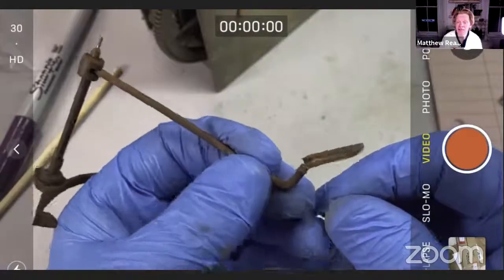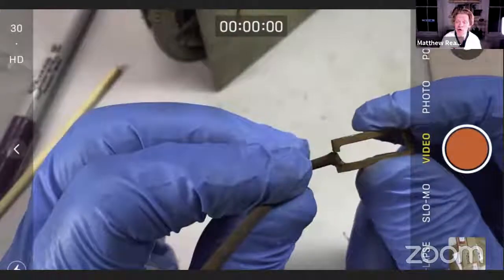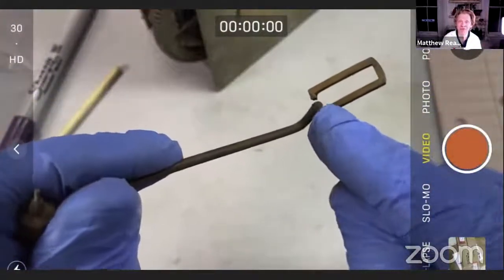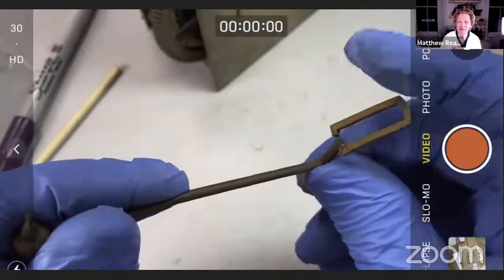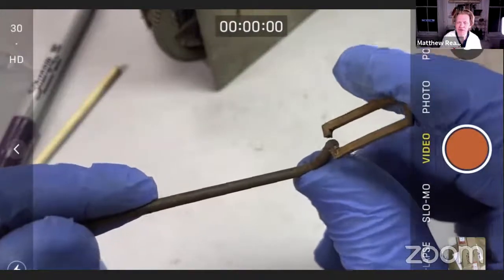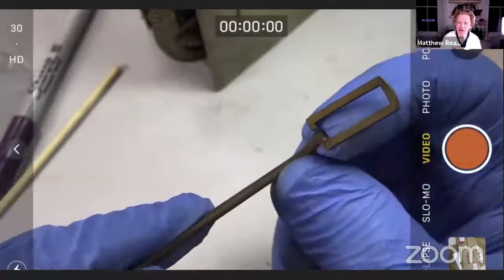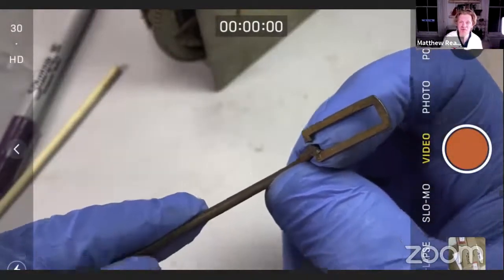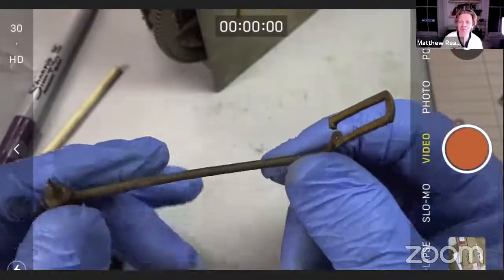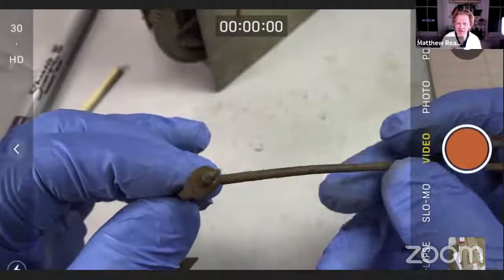And you could, again, being slightly devil's advocate, you could straighten that. And if it'll close up, under normal circumstances, the amount of pressure on this joint is weeny. You know, it's only got broken because it's been fallen over or something. So you could argue that you could just straighten it all and clean it a bit and leave it as it is. But I think for some kind of peace of mind, maybe solder that loop back up with silver solder. So that should actually work out quite neatly.